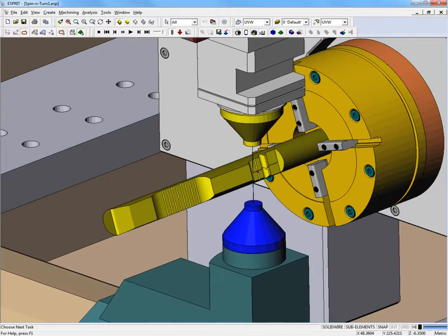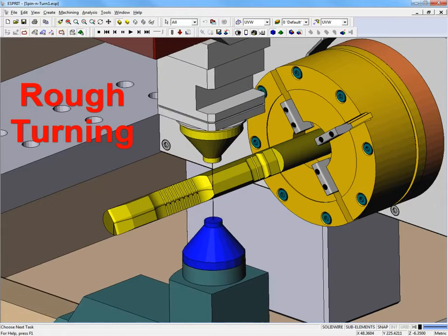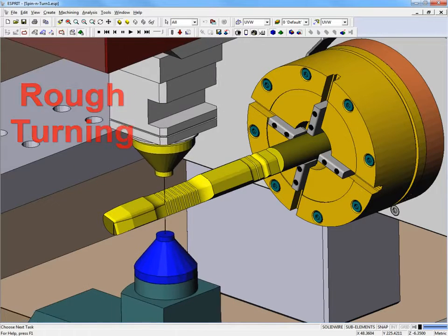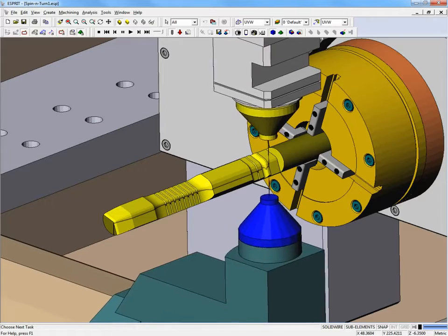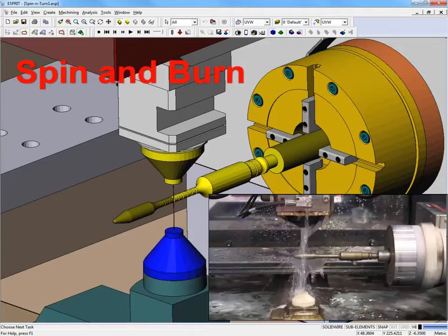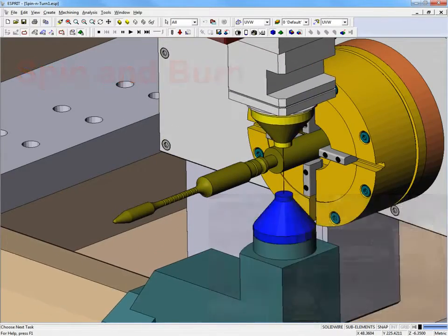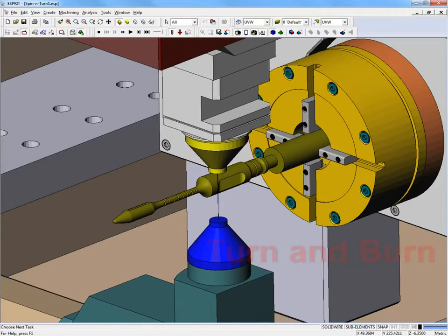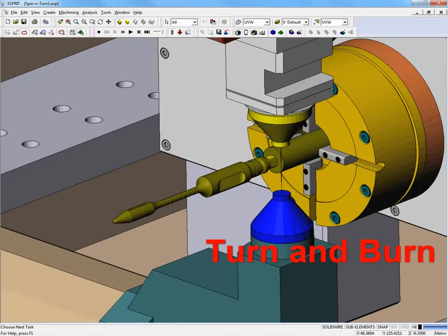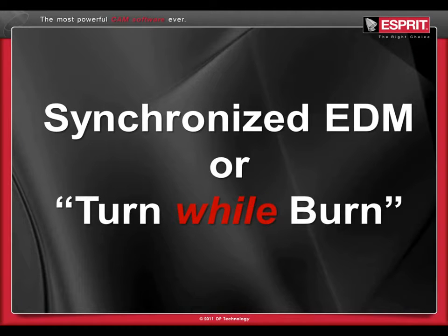It is important to note that small, delicate parts cannot be cut efficiently and with high quality using traditional mechanical milling or turning methods. EDM is the perfect solution for cutting delicate parts since there are no cutting forces involved. It is even more advantageous when dealing with difficult-to-cut materials such as titanium, Inconel, or Hastelloys. These materials are very tough and springy, so when mechanical processes are used to cut them, chatter is a huge problem, causing high tool wear, poor surface finish, and broken workpieces.